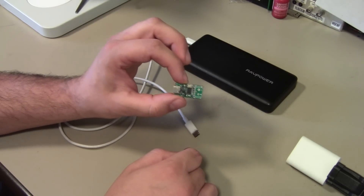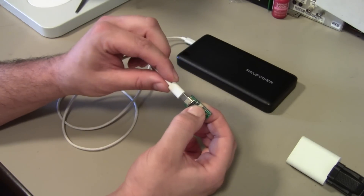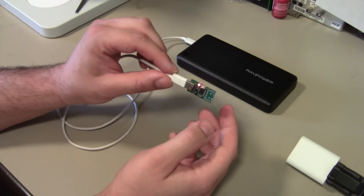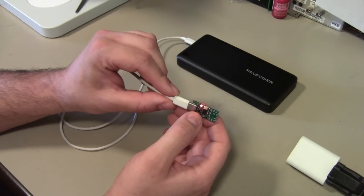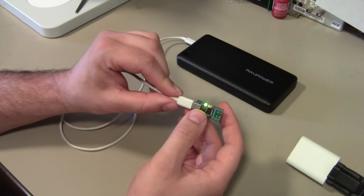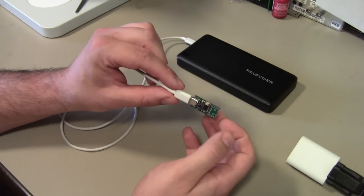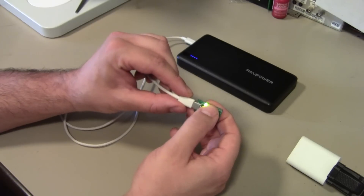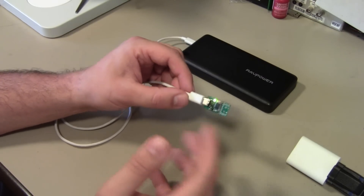It turns out that you can actually program this control board into other modes. If you hold down the user button while plugging in the power, you'll see the RGB LED sit there and blink until you release it, and you can then toggle through all the different modes. The red mode as it comes lets you toggle through all the different modes. Then if you wanted to change it to a different mode, you can select yellow, which means always give me 9 volts. If we wanted to save that, you then just long press the user button until the light goes out. So now, if I unplug it and plug it back in, you'll notice that it immediately goes to 9 volts and the user button doesn't do anything. I've now programmed this board to say: whenever I plug you into a USB power delivery port, just always give me 9 volts.